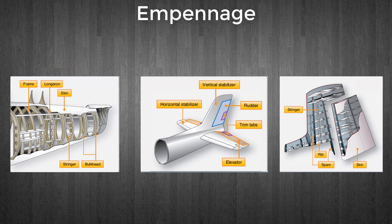The other components of the typical empennage are of heavier construction than the tail cone. These members include fixed surfaces that help stabilize the aircraft and movable surfaces that help to direct an aircraft during flight. The fixed surfaces are the horizontal stabilizer and vertical stabilizer. The movable surfaces are usually a rudder located at the aft edge of the vertical stabilizer and an elevator located at the aft edge of the horizontal stabilizer.